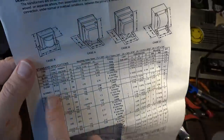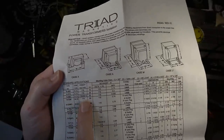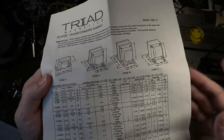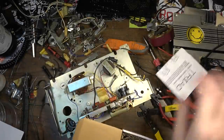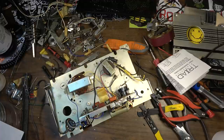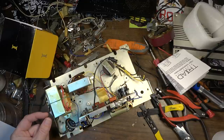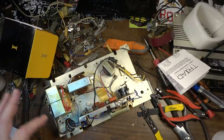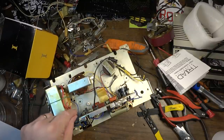So another transformer that I have in my stash is the N68, but that one has the added capability of transforming 230 volts down to 115 volts. So I want to save that for something possibly in the future where I have to do a step down transformer type operation. So we'll use this one before we use the 68, because a 68's overkill. We want to run the switch on the primary, so it'll go to the switch first, out of the switch to the primary. We also want to put a fuse somewhere in that primary line and fuse that, and then on the secondary we will move these connections that are currently on the switch over to the secondary.